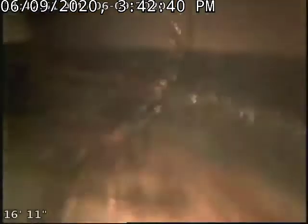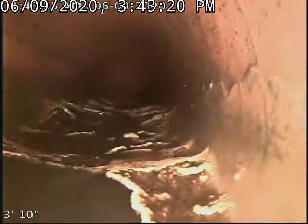We'll pull back through it so you can get another view of what you're looking at. The roots are pushing from below, pushing up — the pipe's breaking on the bottom. It's full of that scaly, calcium-like stuff that builds and builds; this pipe looks a quarter full of it. There's a hole — and there's another one. So we see what we need to do, and then it turns up into this here. 23 feet. Perfect.